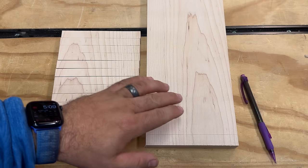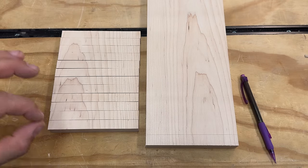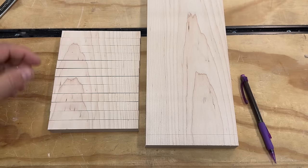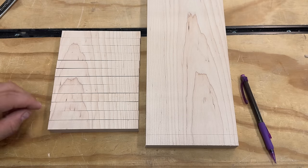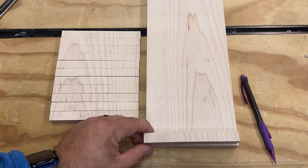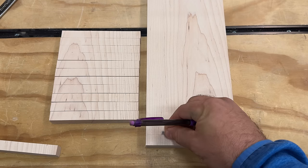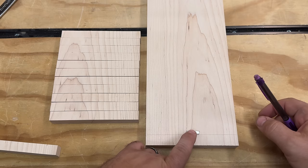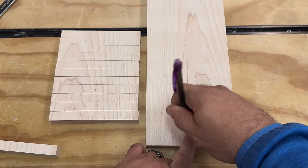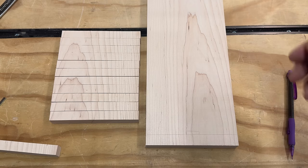If you're going to be making this by hand without a CNC machine, you're going to need your backer board — leave it a little long, at least even a foot — because you might have different spacing than I do. Your wrenches might be thicker than mine, so we're going to go off of your wrenches for the spacing. I cut 12 strips that are half an inch tall, or 13 millimeters, and these will be my spacers all the way up. Place the first one using a pencil to mark a line, and if you're going to do magnets you can place them — you could do one magnet right in the middle to be safe — and now you know exactly where to use your chisel to cut out the pocket. Just wrench, mark, repeat — keep going up the line.